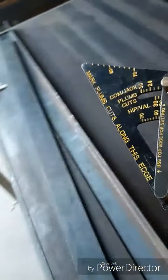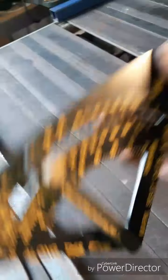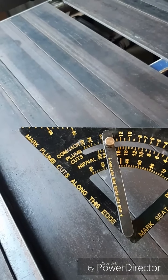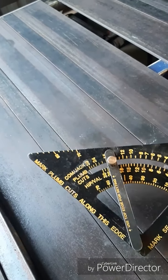The half that hasn't been sprayed has lots of little spatter that doesn't want to come out, whereas this side just wipes straight off — very, very good. The other thing is if you look at the old stand there, you'll see the legs are at an angle, and this actually has an angle set up so I can set the angle when I'm welding and get that extra bit of angle out, staying uniform on all sides.